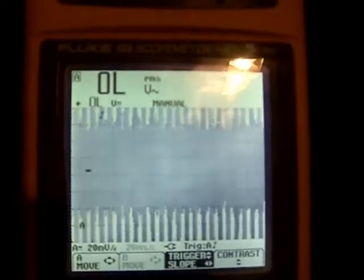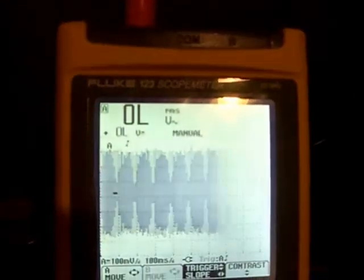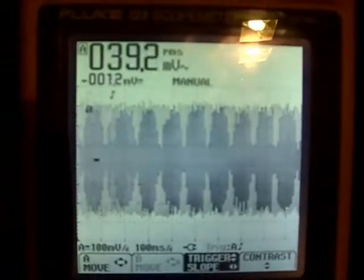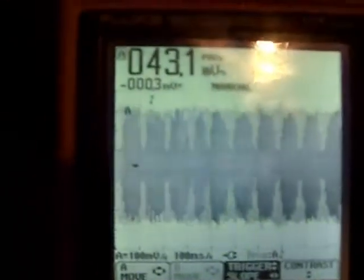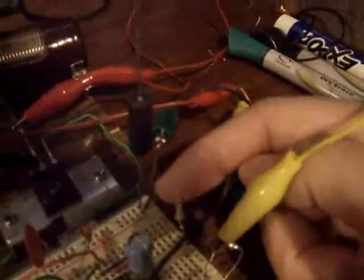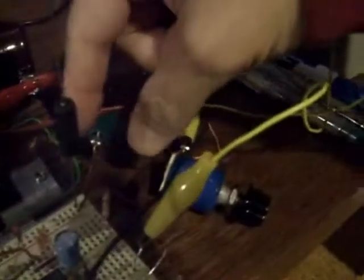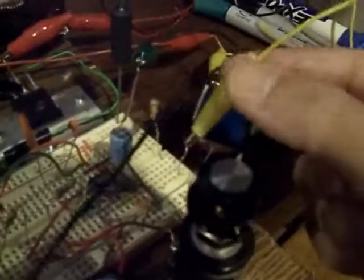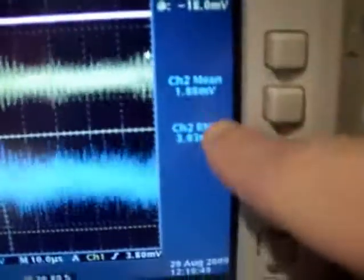The ringing is symmetrical on the top and bottom — about equal but a little bit more negative than positive. I'd have to do a data dump or use the Tektronix to show that precisely. The MOSFET is oscillating and the load is running really well. Now the negative here is going to the negative rail of the timer. I'm not using a separate shunt because the ground is going to this same shunt, measuring both at once. This yellow wire is going through the diode into the positive rail of the timer.